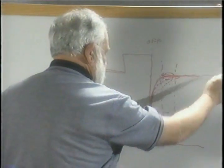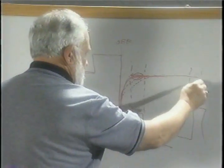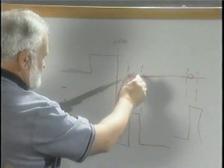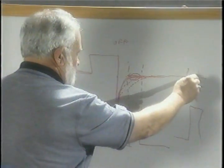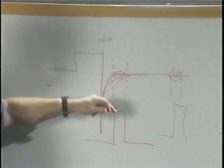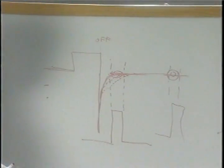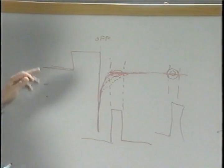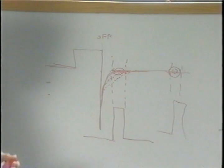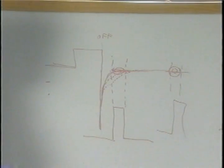There's a second pulse that shows up out here, and this area is long after this initial transient performance here. This pulse is used as a reference to compare this changing pulse to a somewhat steady pulse in the circuitry downstream. That voltage that's developed between those two pulses controls the audio that you hear, and it's what's used to indicate whether the metal is there in the field or not.